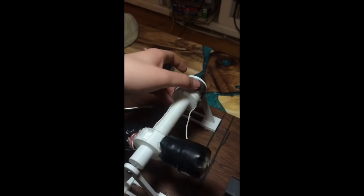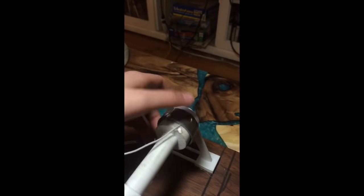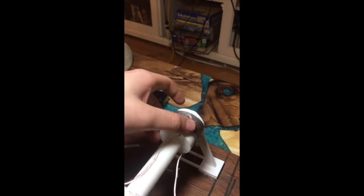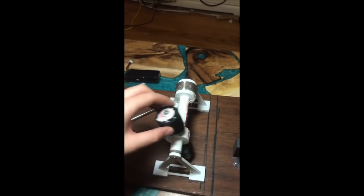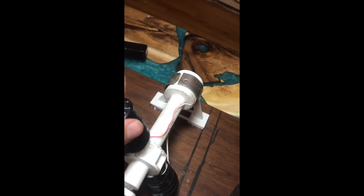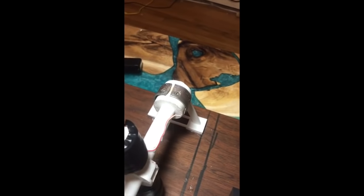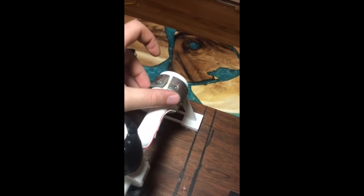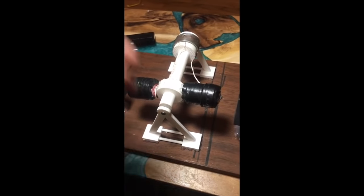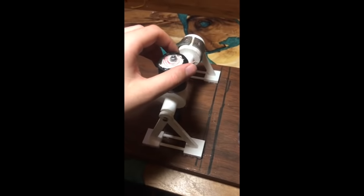Next, I'm going to be talking about the commutator, which is composed of two pieces of metal that I bent to a cylindrical shape to wrap around this 3D printed cylinder. Each one of these coils gets its own side of the commutator. You can see that each of these wires is connected to a coil. An important thing to remember when building a commutator is that you want these two pieces of metal to be pretty close, but definitely not touching.